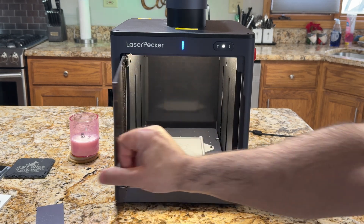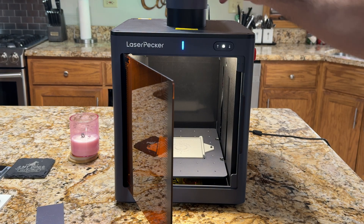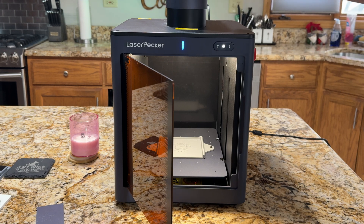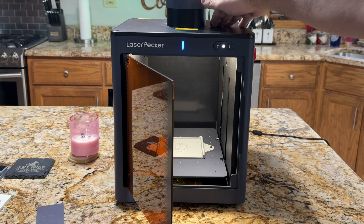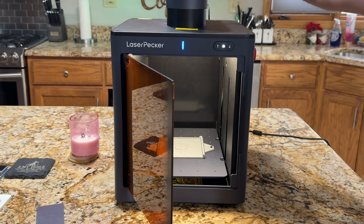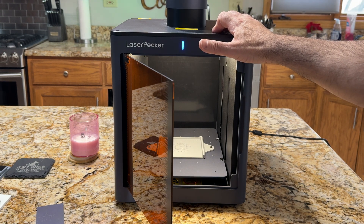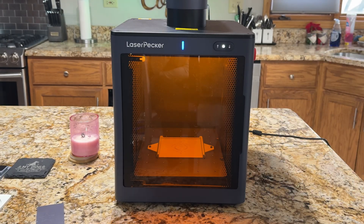The actual LaserPecker 5, when you connect it to the actual enclosure, is connected with two screws and you'll find instructions on that. But one thing to note: even though you have a handle, you cannot raise the LaserPecker 5 and the safety enclosure as one unit by pulling up on the handle — you'll actually break it, because the screws don't really lock in all parts of the LaserPecker 5. It's only holding the front, but the back will tilt forward and that can damage the case and probably your LaserPecker 5 as well. So if you're going to pick this up and move it, grab it like a barrel and move it around that way.